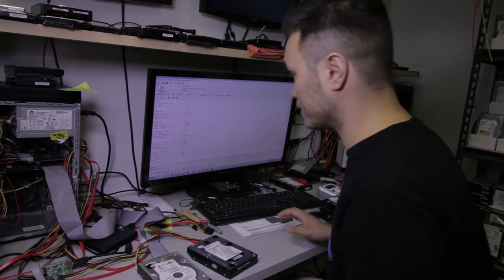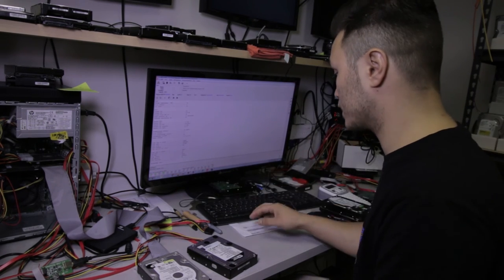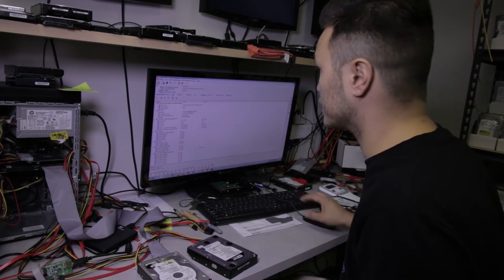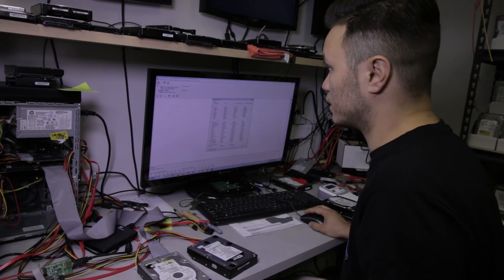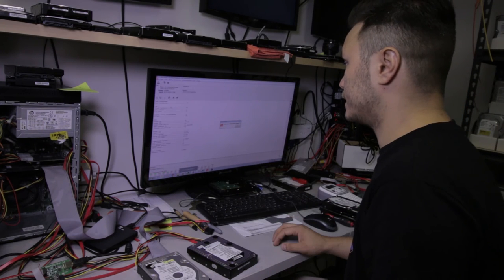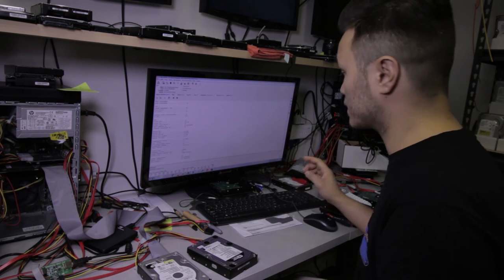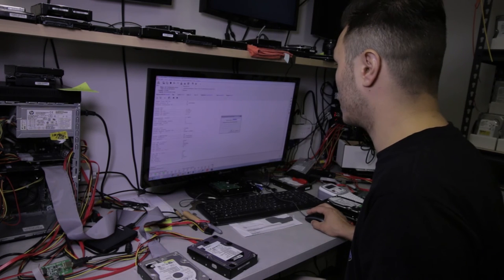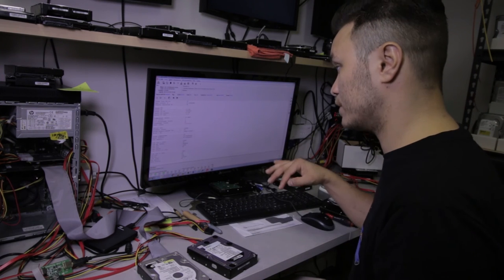But this time it calibrates. And right now we're gonna get proper ready signals. If I hit Alt-P, I should be getting password information, which I just did. So now I have to exit the kernel mode and enter the normal mode for this unit, because it initialized properly, and switch the head map back to the original configuration, which is 2, 3, 4, 5, 6, 7. So we go back into work with RAM. 2, 3, 4, 5, 6, 7. Head map had been changed.